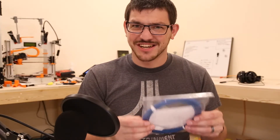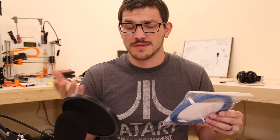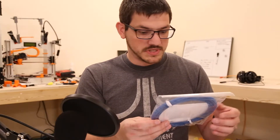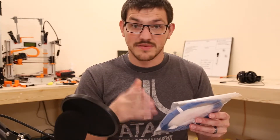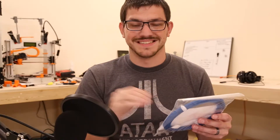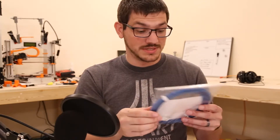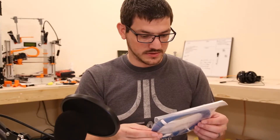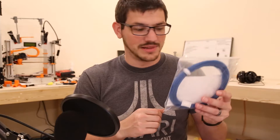The first one I'm actually really excited for. This one is an exotic of sorts, being that it's not PLA or ABS. This is wax filament from Maker Geeks. The settings are: hot end 135 to 150°C, bed 70 to 80°C — a very interesting combination of such a low melting temperature but high bed temperature for adhesion. Speed 20 to 70 mm/s. Made in the USA.